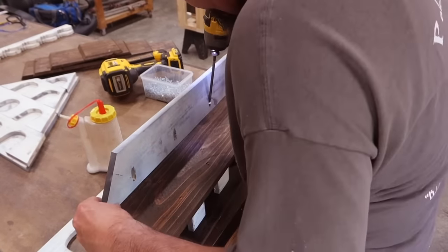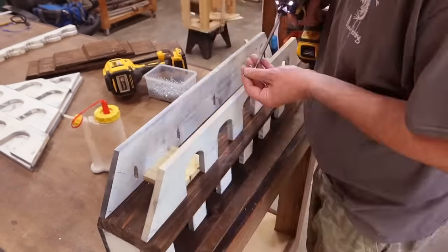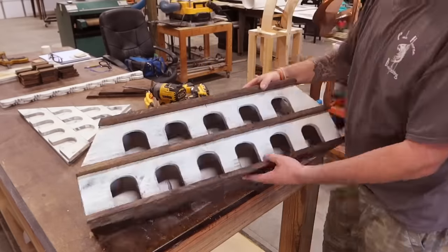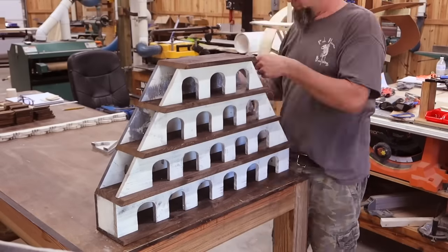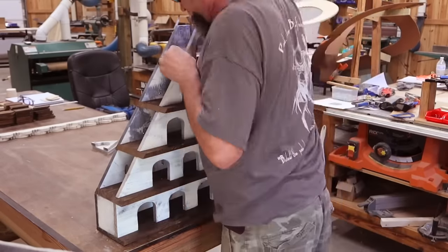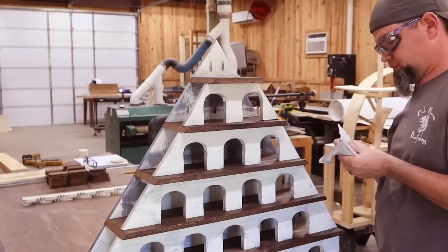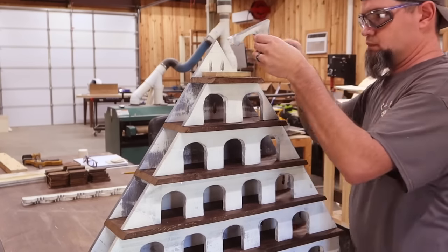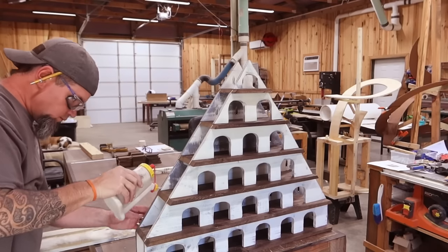Now we're ready for back wall B, and we're just going to be repeating this process. These are just two little four inch blocks that help out with the spacing whenever I'm putting all this together. We'll repeat this process for each of the different levels until we get to the very top. So, you remember how we did not put pocket holes in part F — this is why. I'm just going to use some CA glue here; you can actually just use wood glue. But once you put the sides on, it's really not going to matter — it's going to lock everything in.